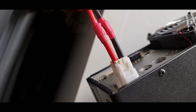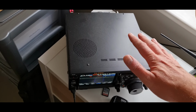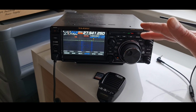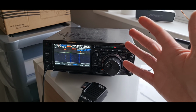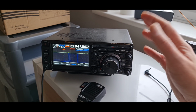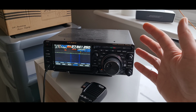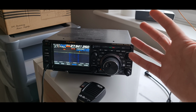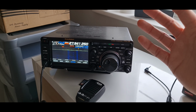Also, some of you guys have mentioned the DVI socket on the back. The reason they couldn't put an HDMI one is because of licensing. I totally understand that, actually, having been into embedded computers and run a business around it as well. But I did try a DVI to HDMI adapter onto one of my little 4K monitors that I've got, but that didn't work. Surprise, surprise. So I'm going to try a proper DVI monitor. There are reports as well that if you do use a DVI to HDMI converter, it can knacker the video card in the radio, which just really ain't good.